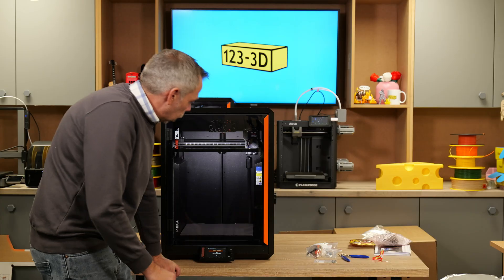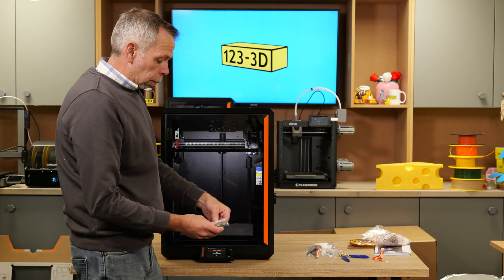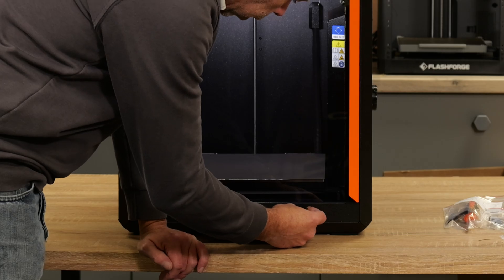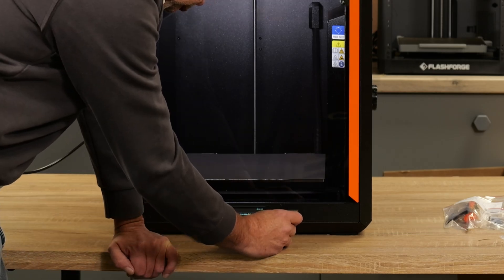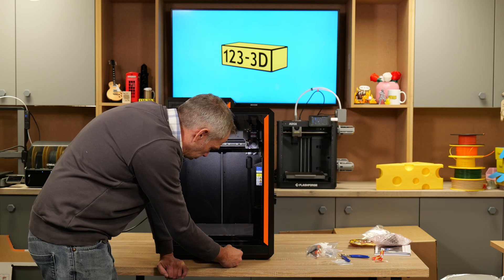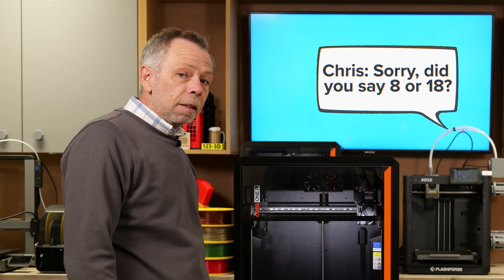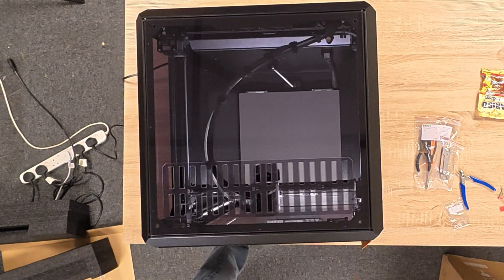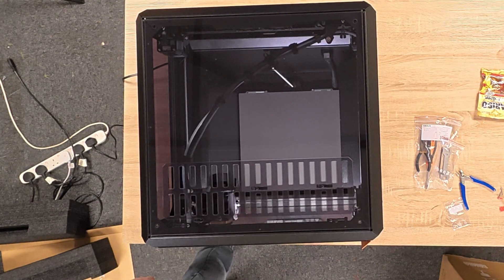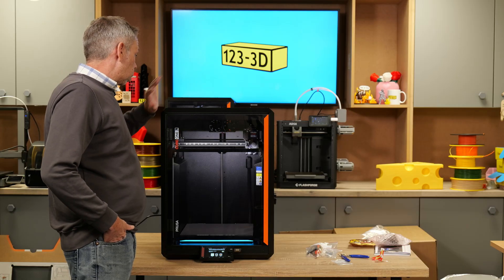We shall click yes. It'll retract a bit of filament. I'll find the USB drive, pop it in and see what's on it. Lots of things, including Bonkers Benchy, which claims to print in eight minutes — let's see what it can do. Press print. Here we go. It's come back to confirm the vent is in the open position because we're printing with PLA, which it is. That's all good.